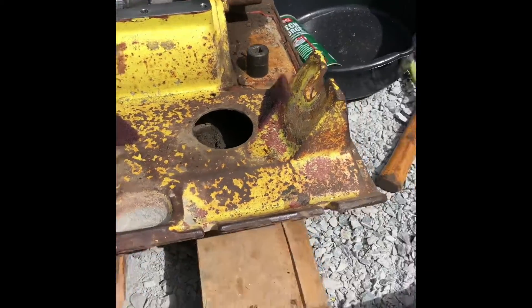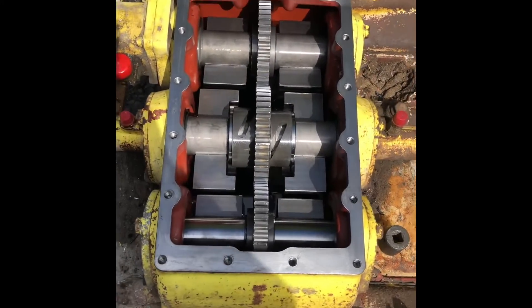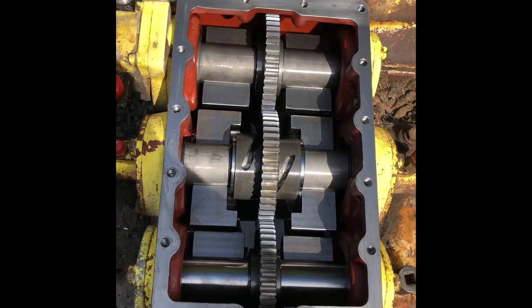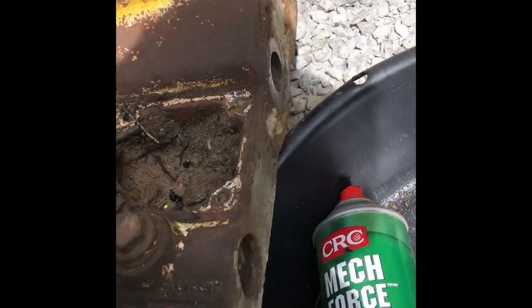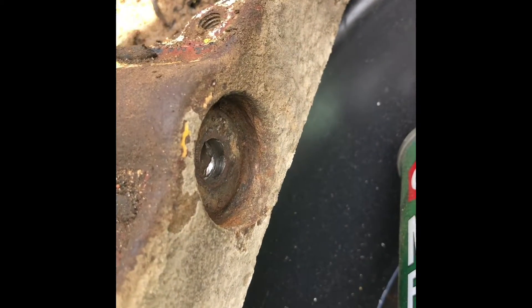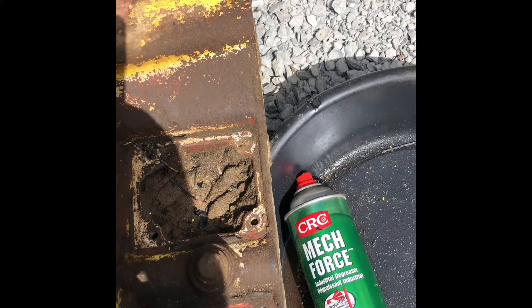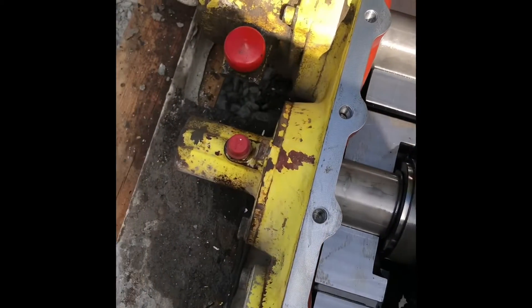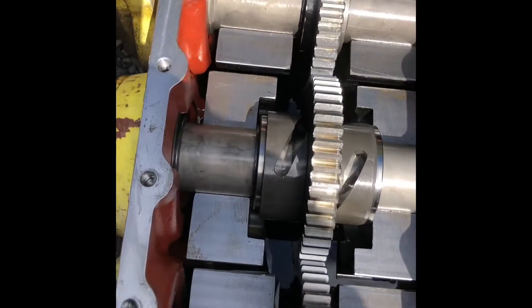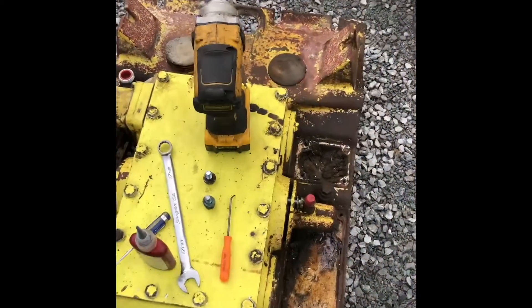This is an AVH 6030 Ammann compactor - this is what it looks like with the cover off. It's a triple exciter and it's activated from either side. To drain the oil, I believe it's a 10mm Allen, but it's stripped on this one. You've got to pull the side skirting off - there are 30mm head bolts on there really good with red Loctite. I pulled the cover off to see what was going on inside and I want to check the plungers on either side. It looks like they had black RTV on it.